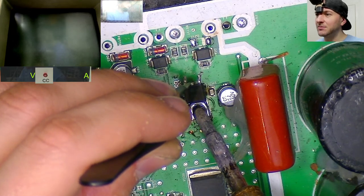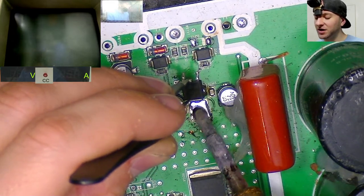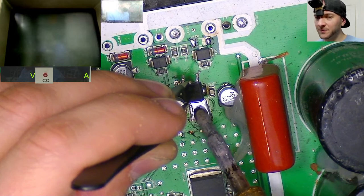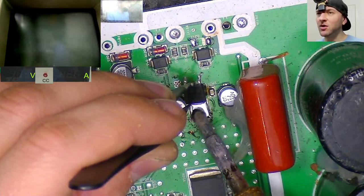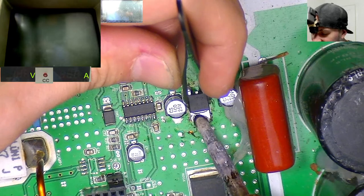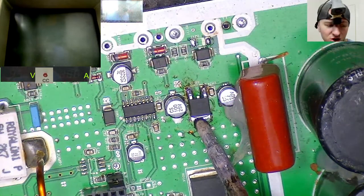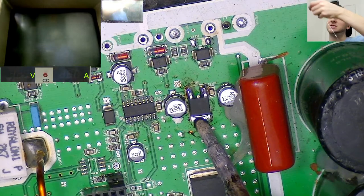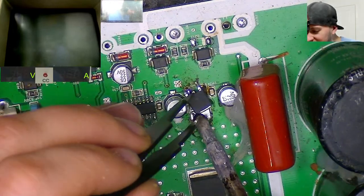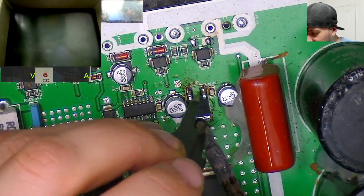My question is, do you repair more defective amps or more user error? So, that's a good question. Are more of my repairs user error or just random component failure? That's a tough question. Honestly, I would say random component failure. You get a fair bit of vibration damage. I would say the number one user error is vibration damage. But aside from that, most things are literally just output FETs have died for seemingly no reason. So yeah, it does seem to be mostly amplifier faults.